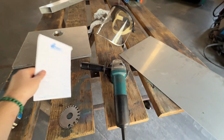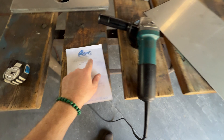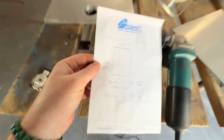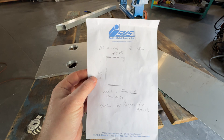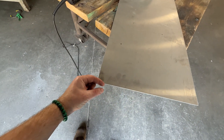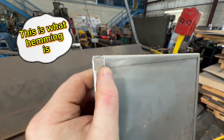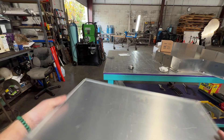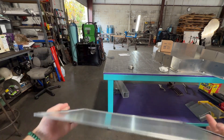Today's simple little project is a piece of aluminum plate — 16 or 18 gauge, about 20 and a half inches by 12 and a half inches OD. I've got to hem it too, with a half inch hem on each side all the way around. Hemming is basically just folding the ends over and mashing it down — makes it stronger. It's gonna get painted, so cool.